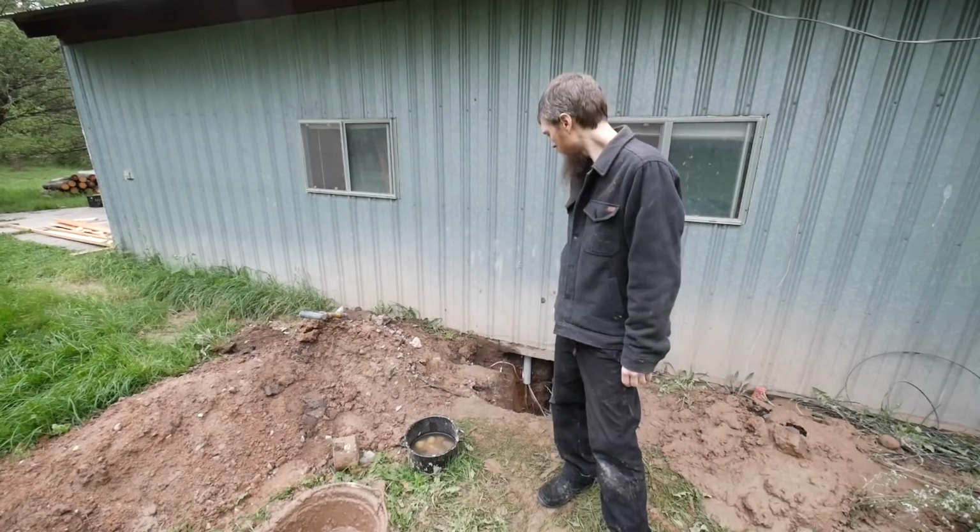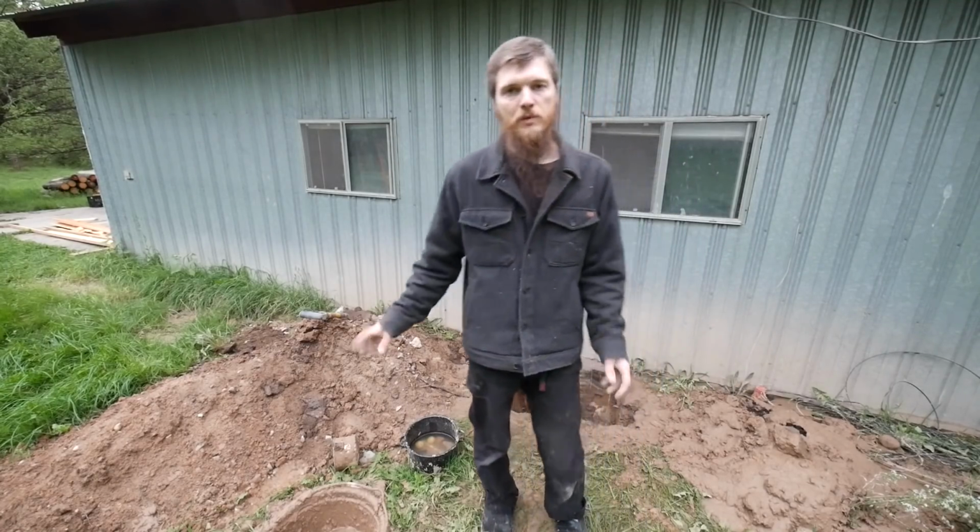And speaking of the ground wire, I know some people are going to be concerned because our electrical box is a 3-wire service and it's a sub panel, and everybody says you have to do a 4-wire hookup, which means hot, neutral, ground. And here we only have 3 wires coming from the house, the hot, neutral, and we have a ground rod out here. While in most places this isn't up to code today, it wasn't many years ago that it was allowed. A 3-wire hookup isn't terribly dangerous. There's just a better, safer way to do it now, so they've updated the codes. But it'll be fine.